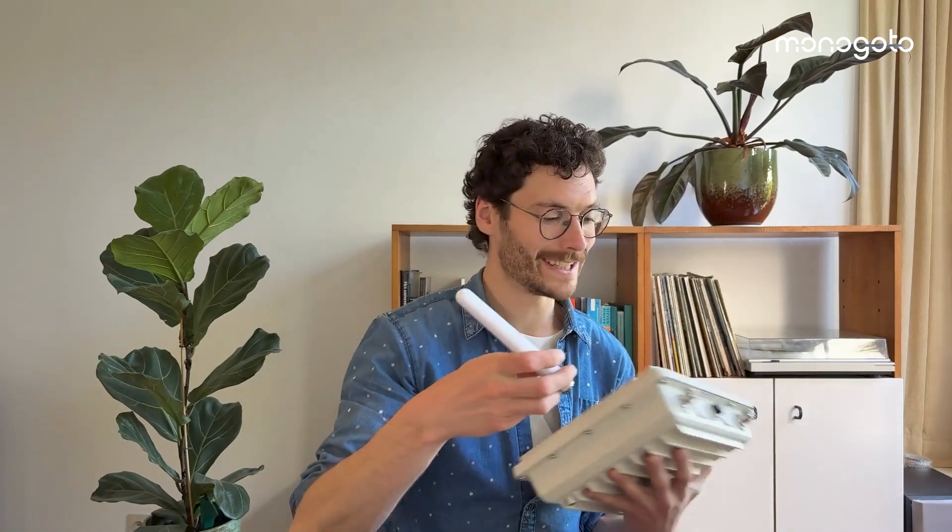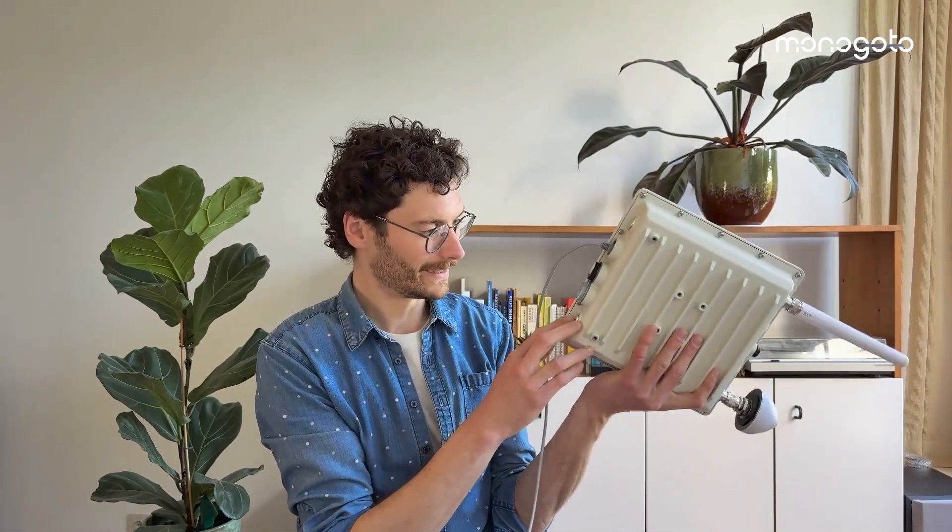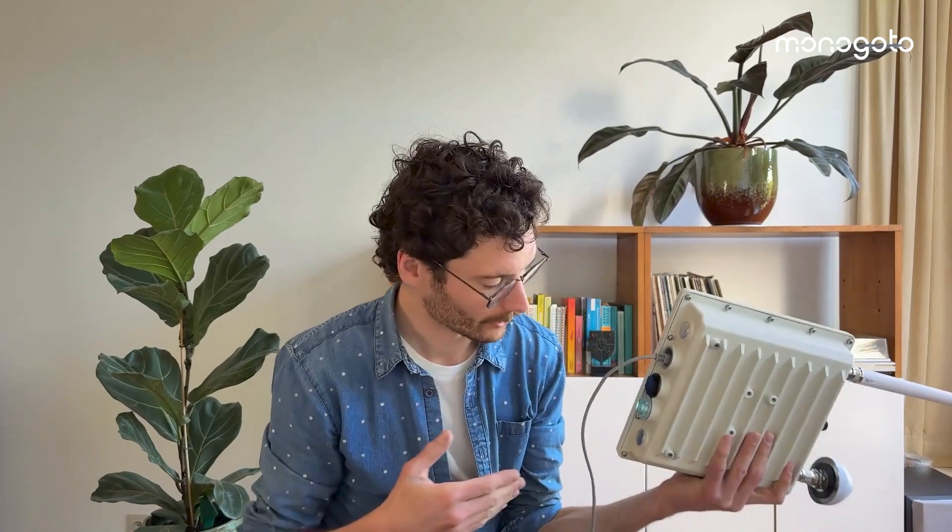Let's put things together. We take the radio and the LTE antenna, then the GPS antenna that goes on this side, the power adapter, and connect the ethernet cables. The port labeled 'Out' goes to the radio, and the one labeled 'In' goes to your local router. We take the power cord and connect it. If all goes well, you should directly see some LEDs starting with red, and eventually that should become green and white, indicating that there's both a connection to internet and to the Monogoto cloud.